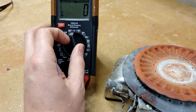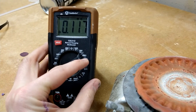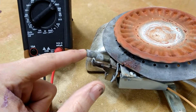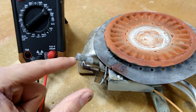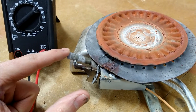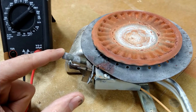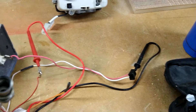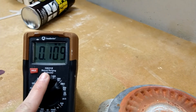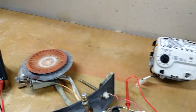Mine's not working so we're going to use ohms instead. Ohms measures resistance and will tell us whether there's an electrical path through the thermocouple. I'm an aircraft electrician, and this is exactly how fire detection systems work on aircraft. We're going to apply a flame to the thermocouple as it's hooked up and see if the reading changes. Right now we've got pretty good continuity — the lower the number, the easier it is for electricity to make it through the circuit.